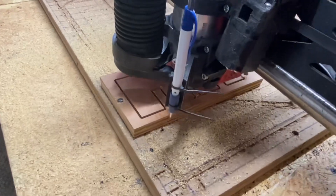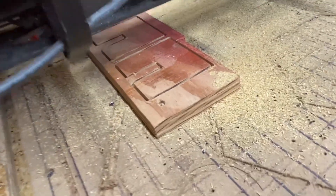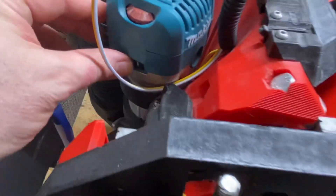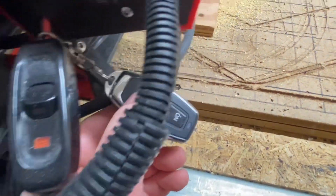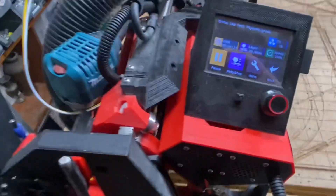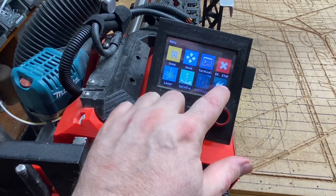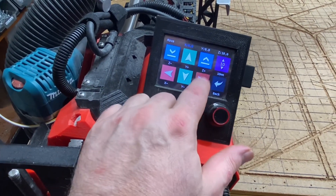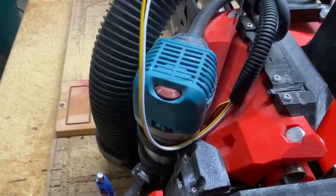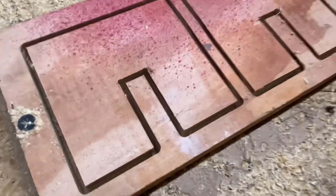I've actually had plywood that was ostensibly 3/4" but was actually thicker than 3/4", so there's a lot of variation out there. Whatever plywood you get, you need to really measure the thickness very carefully and use that exact measurement in the parameters of the Fusion 360 file. If my DXF cut plan doesn't exactly match your plywood thickness, you'll need to modify it with a 2D vector illustration editing program, or have me or someone modify the DXF so the notch width exactly matches.